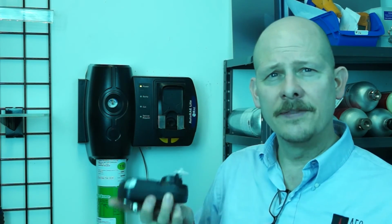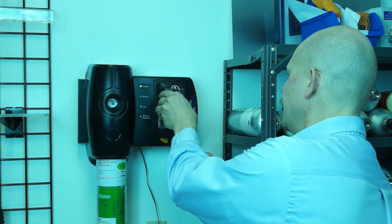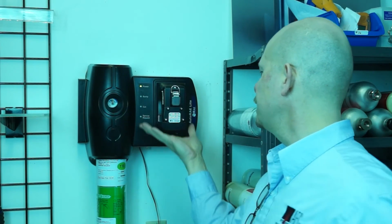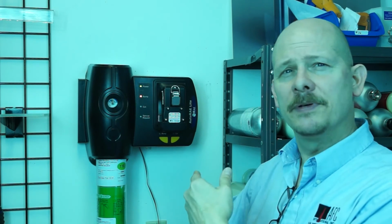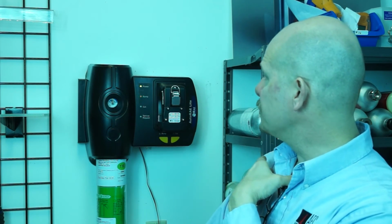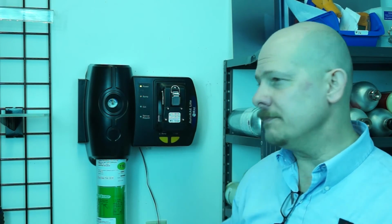I'm going to go ahead and take the meter again, the Rae 2, and do another bump. Stick it in the instrument, close up the jaw here, hit the bump test button, and again, I'm doing another 20-second bump, and we'll see what happens here. I got my light flickering here. It's like an amber yellow color flickering on the bump, and in 20 seconds, give or take a few, it's going to give me a green light, go, or a red light, no.